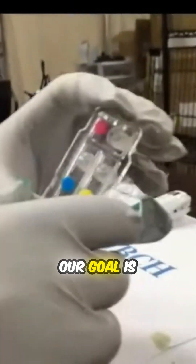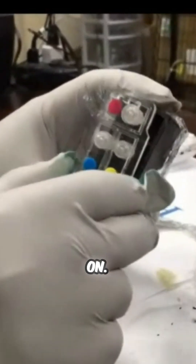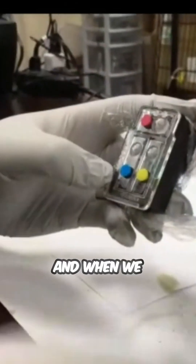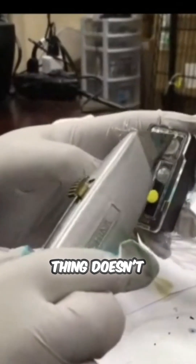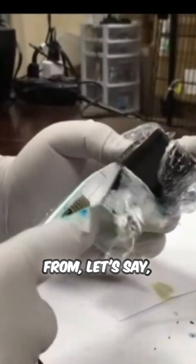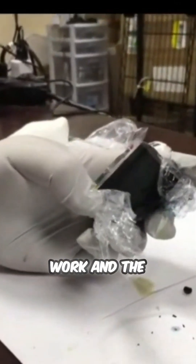So our goal is we're going to glue this cover on, and when we glue that on, we make every chamber be airtight. This is really important. If you do not make it airtight, this whole thing doesn't work, because if it's not airtight, the air can get in from — let's say, from the seam — then your pressure regulator is not going to work, and the ink is going to flow out.